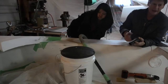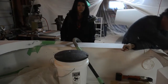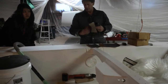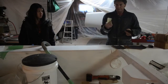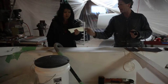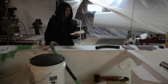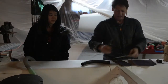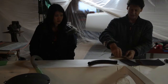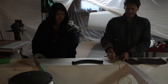That was all one solid bulkhead. And right here on that side, there was a hole similar to this. So I figured out whatever the laminate was. I'm going to just measure the laminate. I looked at it, 1/4 inch or 3/8. And I made a big sheet of glass. And this surface is using melamine. Held it, put a cleat across it, and padded the cleat where it met this, and glued it so that it was just below the finished surface. Right. And then used crazy fill glue.